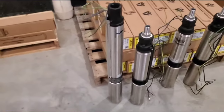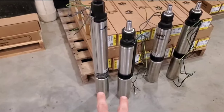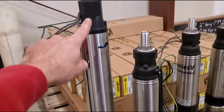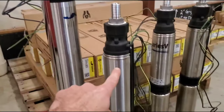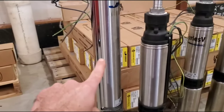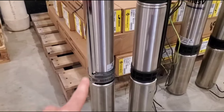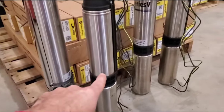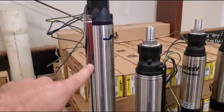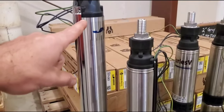What I'm going to show you here is what I go through before I install a new well pump. If you check these two pumps out, they're both three-quarter horsepower, but you can tell a considerable difference in the stack. This right here is a five-gallon-a-minute pump and this is a ten-gallon-a-minute pump. The smaller pump pumps a higher volume of water, but the five-gallon-a-minute pump has the capability of pumping from a deeper depth. That one has probably a max working depth of about 280 feet, and this one will run out somewhere around 415–420 feet when it stops being able to produce enough pressure to lift.